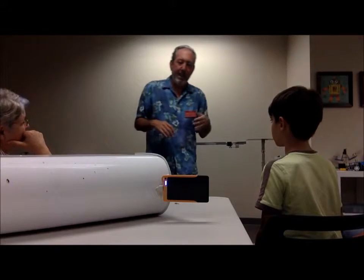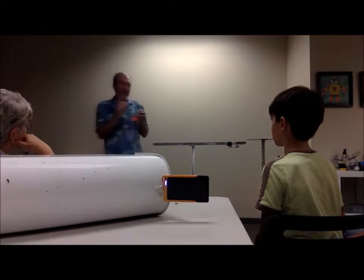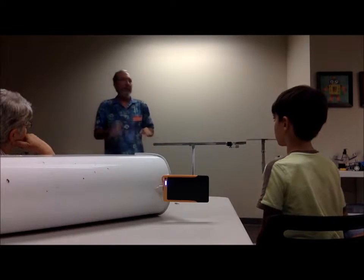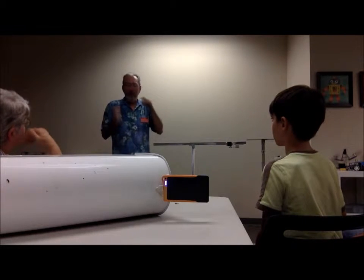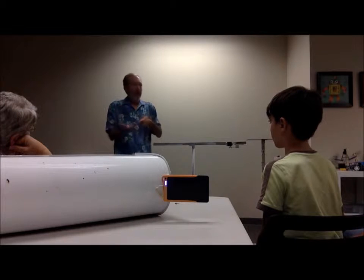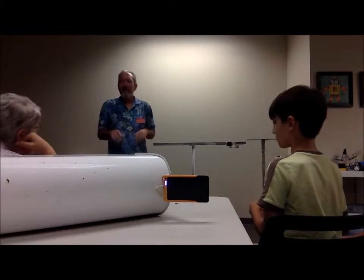So to do it, I took several steps. I stole some software. Not stole, I borrowed. It's open source, whatever. Some software that worked on this board that basically shuts the board down completely. Literally turns off all the power on the board except for a watchdog timer that wakes up at whatever frequency you want. So I have it wake up like once a second just to do what it needs to do. And set up some interrupts so that certain things like pushing the button would wake it up immediately. But basically it totally shut the power down.